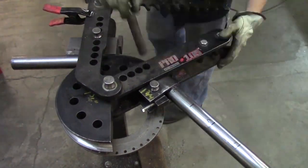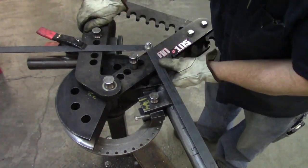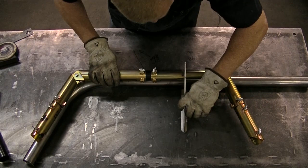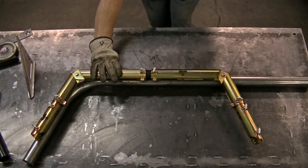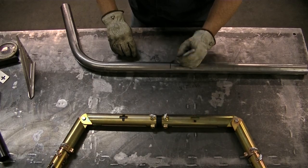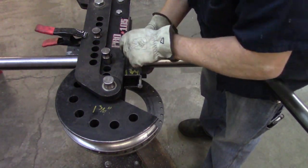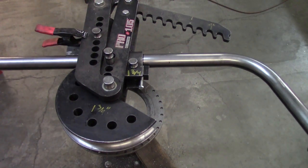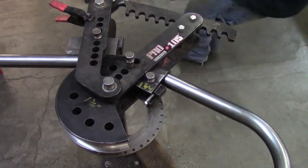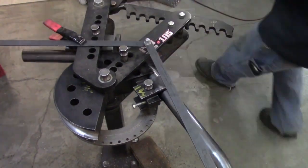I just changed this on my bender for the video so you could actually see a little more. Then I use my angle finder and just bend it until the legs of the tube line up with the angle finder. Now I can check the bend by setting the tube jig on top and using a speed square to make sure everything's square and then just looking at my marks. Everything's looking good. So now I can transfer my start mark to the other side of the tube for the second bend. I like using a manual bender because I can actually feel when the tube bends at the very end of the bend, so it helps to make it accurate.